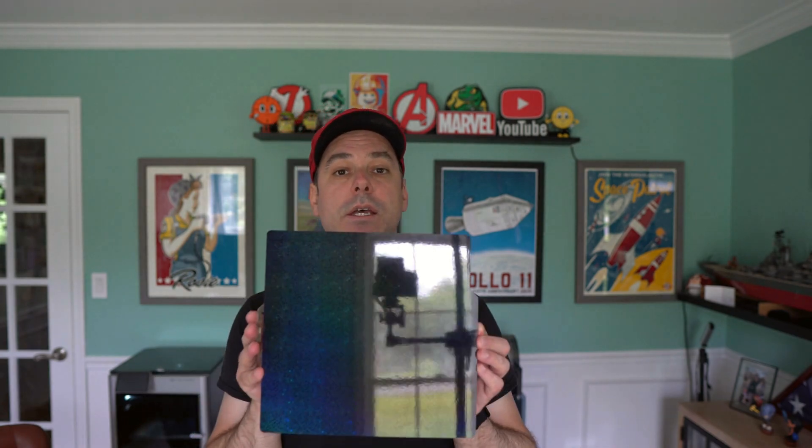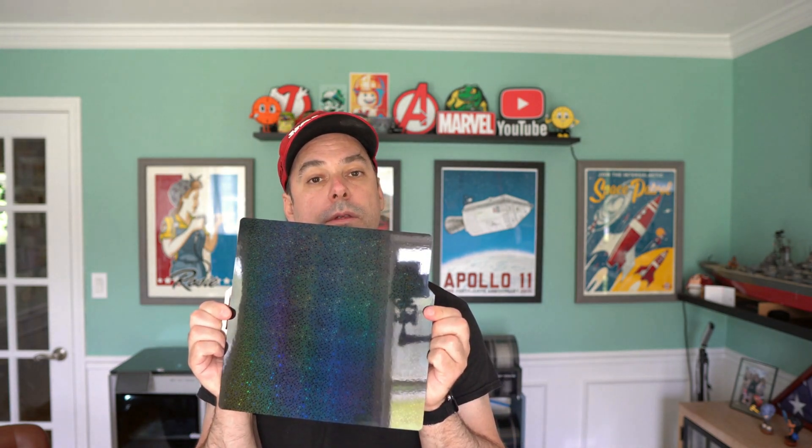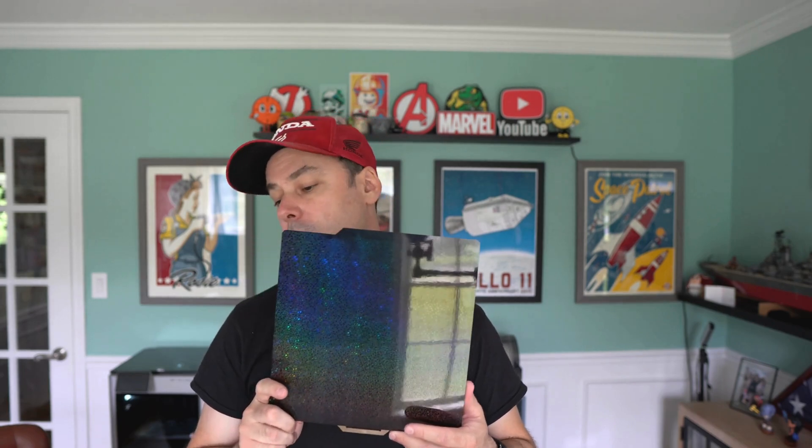The first one we're going to work with is our PEY rainbow pattern. I don't really see a need to test the PEI — we know that works pretty well, so we're all more curious about what they're calling PEY. For our rainbow PEY print settings, we're going to use our X1 Carbon. The big thing here is your plate type — they recommend using the smooth PEI high temp plate setting. I'm going to roll with just the default temperatures for PLA and we'll see what we end up getting.